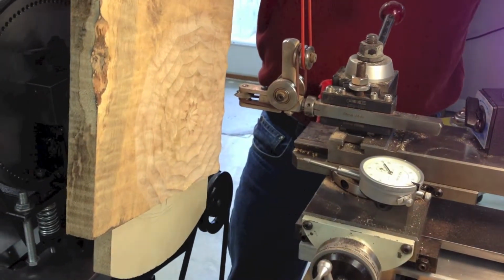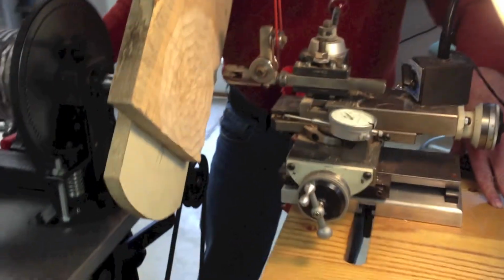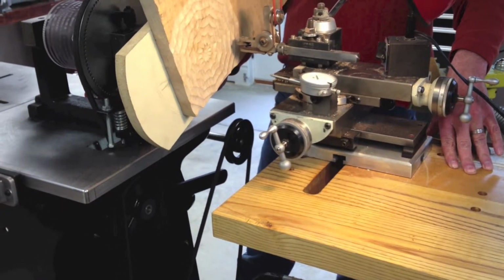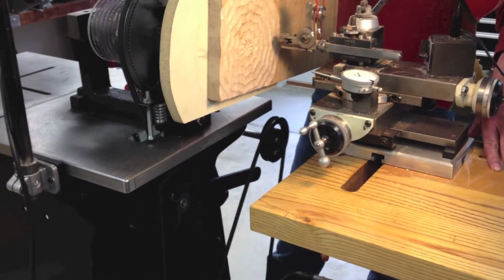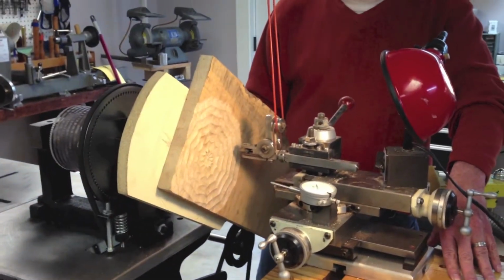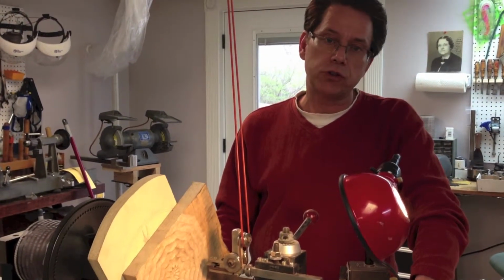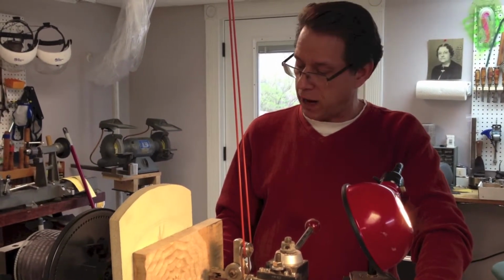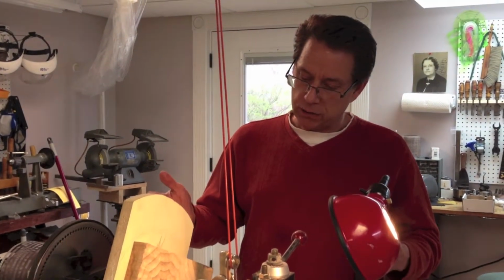So in this case, all I did was set it on the old wooden top table that came with this machine, and then I had to put a 1/2-inch shim under the Rose engine to get it on the same center line. So it's a fairly easy process. It probably would mean that you have to move your Rose engine close to a machine in your shop, which I'd say this whole process only took me about an hour and a half to complete and get ready.